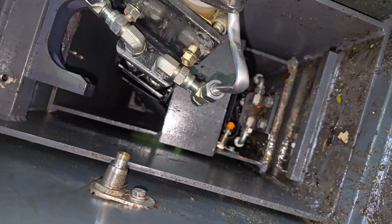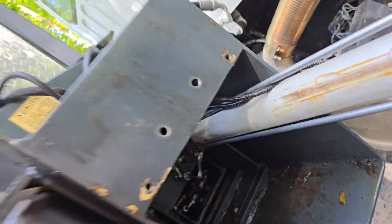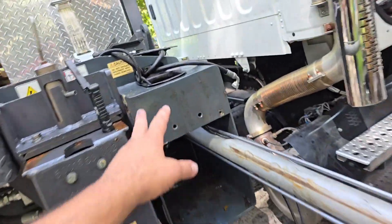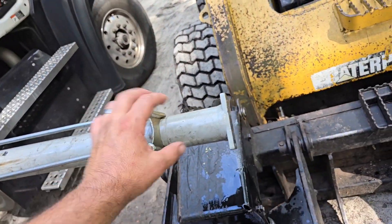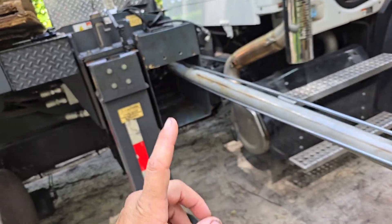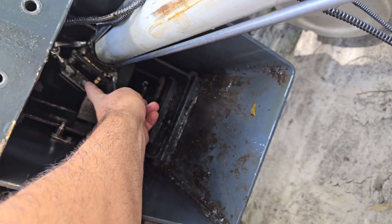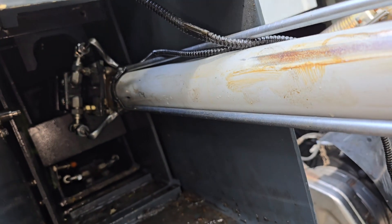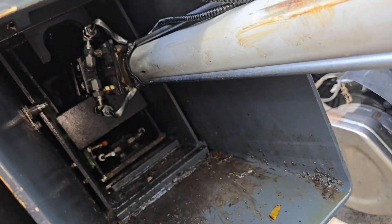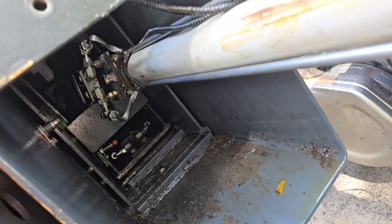And it was a pain to get to. There's no twisting or it'll pop out — that keeps everything in line. Once you take off these two bolts that are actually holding the back end of the piston, and then the three hydraulic lines that all connect back here — two here, one on the top — and then four bolts on that side, this cylinder was able to slide back until it got to this point, to which we had to twist it to get past that plate so we could reach these fittings here to tighten up. Now that we've got those fittings tight, we're going to push it all back in.